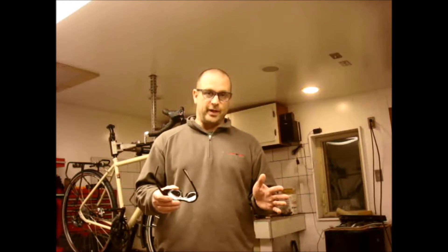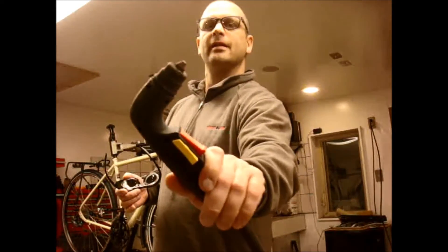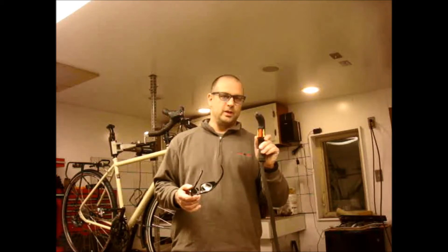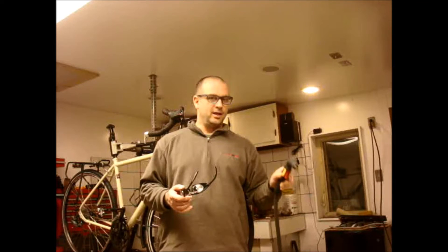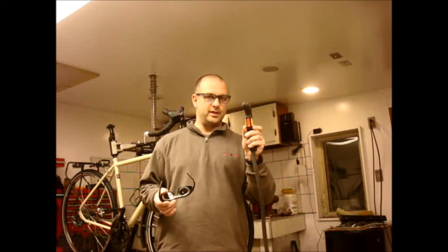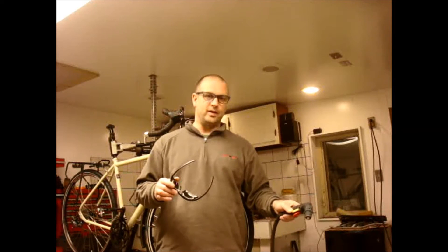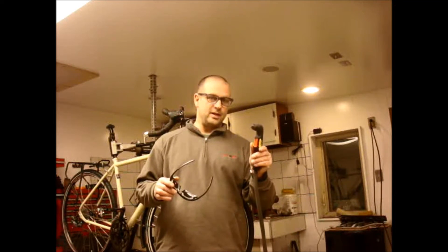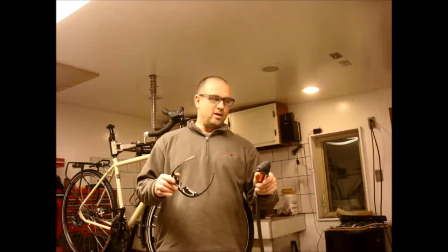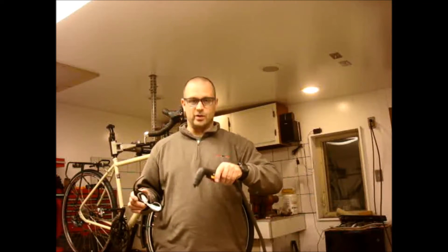Here are a few pointers. I'm going to be holding the tip of the plasma cutter about 1.5 to 2 millimeters away from the aluminum surface I'm cutting. If I touch the tip, it's not going to work. If I get too far away, it's not going to work. So maintaining proper distance is very important. If you can't freehold it by hand, you can put little jigs on here to help. You can buy jigs that make straight lines, circles — especially in steel you can drop a magnet with a little wheel jig that'll run in a circle so you can cut perfect circles.